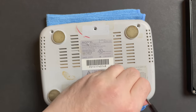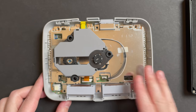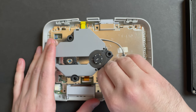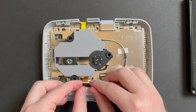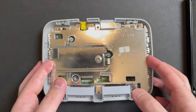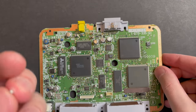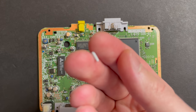Let's flip the system over and the cover should just slide right off. This is one of the easiest systems to take apart — six screws and you're basically in. There's very little else holding anything down. So this cable plugs right out, then we have a ribbon cable right here. The optical drive just comes right out, the metal plate comes out, and then we can just take the board out. That probably cracked off from the top case — we'll see about gluing that back on later.